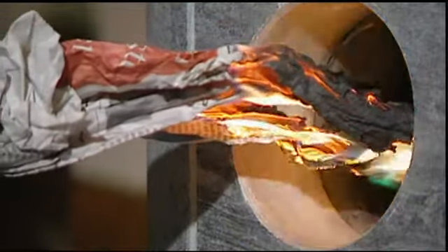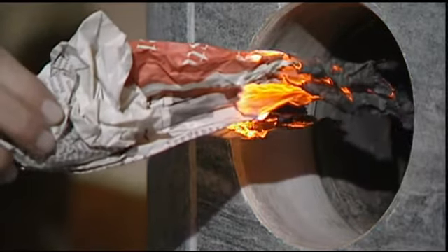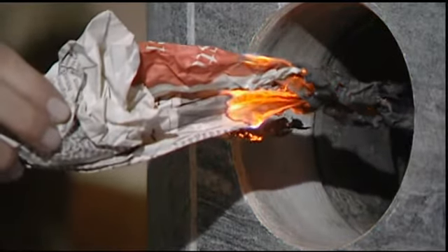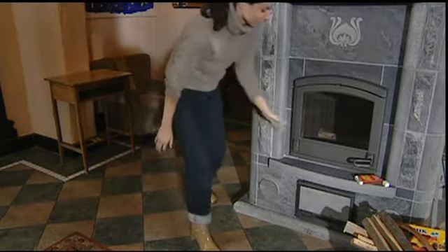After the initial curing process of the fireplace, you can start with a test fire in order to prime the draft in the chimney. It's quite simple. Open the soot plug and burn several sheets of newspaper inside the base channel. Then close the soot plug.